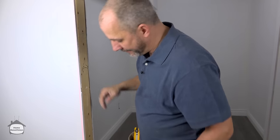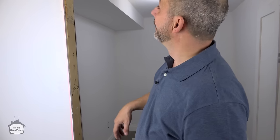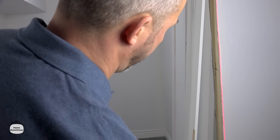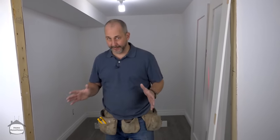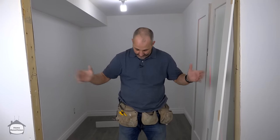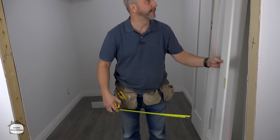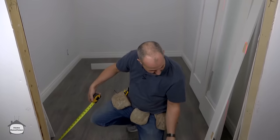In the world of framing, that's actually pretty straight — it's not a big issue. We should double check the other side as well. Give or take an eighth or quarter — that's actually pretty straight too. So all things being equal, let's assume these are relatively plumb and our hole is 50 inches. That means it should be about 50 inches at the bottom as well — we'll just confirm that.